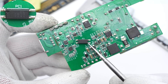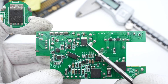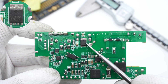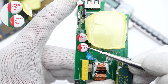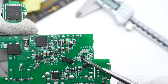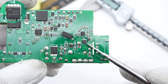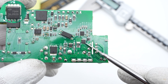This optocoupler is used for output voltage feedback. The synchronous rectifier is from JJ Micro and adopts PDFN 5×6-8L package, 100V, 9.2mΩ. Those two filter solid capacitors connected in parallel are from HYNC-DZ, 680μF, 25V. The protocol chip is from Kanyan, which is actually a high-integrated USB PD fast-charging controller. And the VBUS MOSFET below it is from AOS, adopting DFN 3×3 package, 30V, 4.1mΩ.